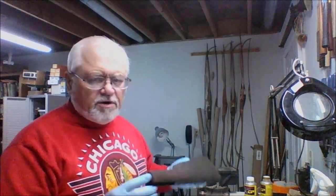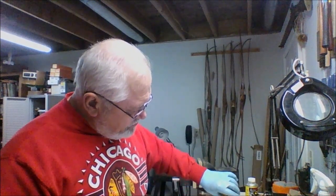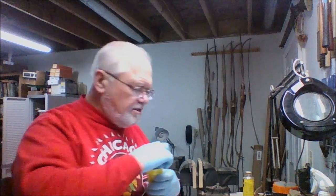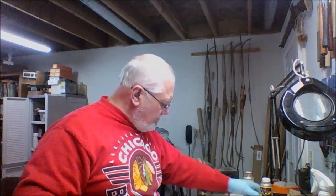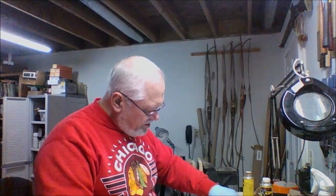Okay, Alpha Charlie Papa, we're ready to put our second coat on — our first coat is dry. It's pretty much soaked in; as you can see it's still very flat, there's no shine to it at all. So we're going to take the leftovers from yesterday, add some new finish to it, and once again use our 220 grit wet/dry paper. This second coat is probably going to soak in just as much as the first coat did — this is still pretty much acting like a sealer.